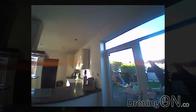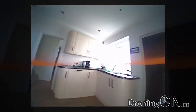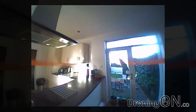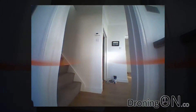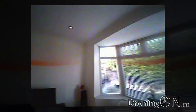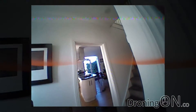On take-off, this quadcopter feels fairly stable and I go for a basic lap around the kitchen. The one thing I notice is that it's a bit pitch-happy: when flying forwards or backwards and releasing the controls, this little quad seems to want to dive in the opposite direction. I suspect this is a PID tuning adjustment which can be made via Cleanflight to improve handling. This quad is not quite as easy to fly straight out of the box compared to the Eachine QX90, but with a little tuning I believe it has potential.